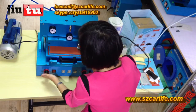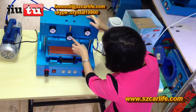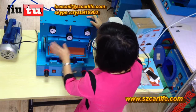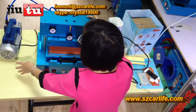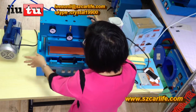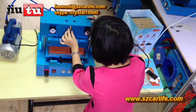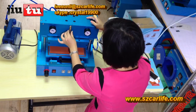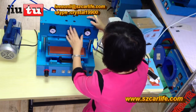This one is for you to adjust the gauge. And here, this is for the vacuum degree — no need to adjust anything for this one. This one is the vacuum degree connected with the vacuum pump directly, so whatever your vacuum pump degree is, the value will show here. These two buttons you do not need to touch — not too tight and not too loose is ok. Usually no need to touch them.